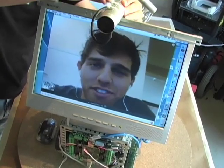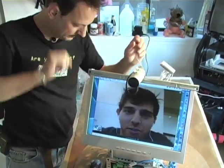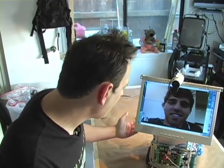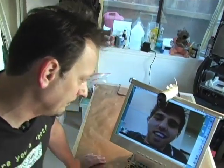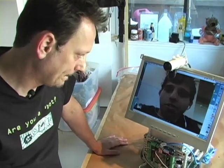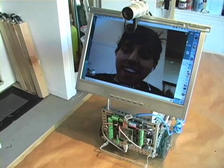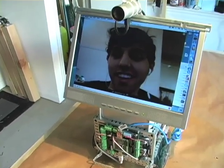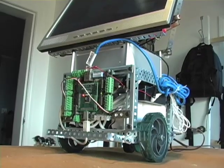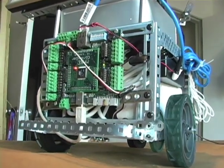Hello, I'm John Salenzo. I'm a first year grad student at Stanford University and I have had the pleasure of writing the software that makes Sparky communicate these days. So what exactly are we doing here? How are we using Skype to drive Sparky? Well, the nice thing about Skype is that it has this plug-in interface, kind of an open source way for folks to write plug-ins. So with the text messages in Skype, I can actually send a text message through my plug-in. It gets mapped to a key — I'm going to hit forward — and once I hit forward, that maps, goes over, has the text message, and then gets received and turned into servo motor actions.